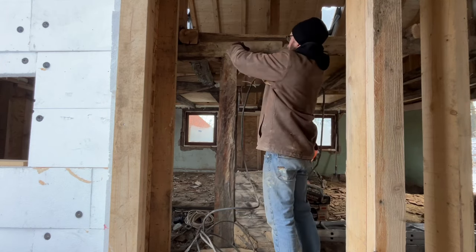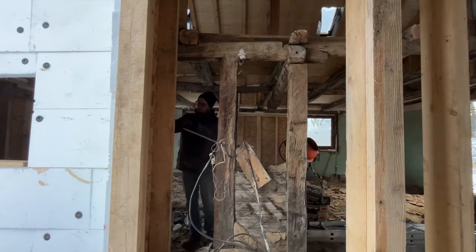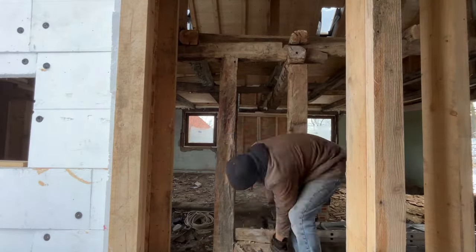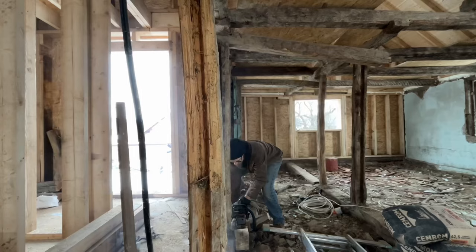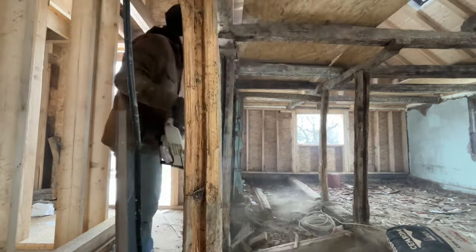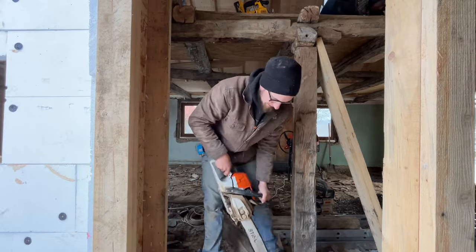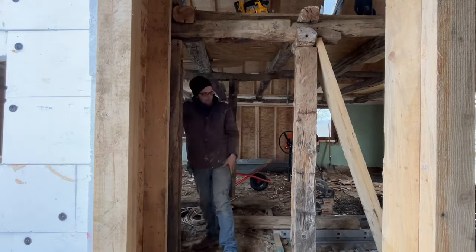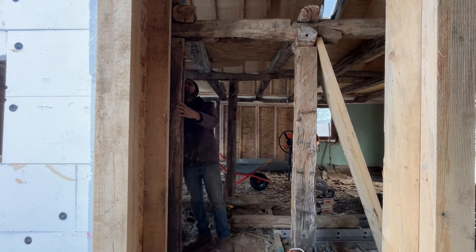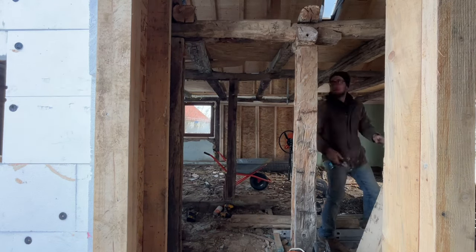First of all, I had to get this front entrance adjusted here. This is where you step inside the door right here, and then this is where you step down into the main house. I had to tear apart this wall that was left standing and then move this post over a bit to make it line up perfectly. There was another beam going across the top that I had to take out, and we had to replace two of the posts in the middle there. I used some new posts, poured foundation and footer. This is just getting that post on the other side of my door to fit in nicely so my drywall can come up basically halfway in between and it all looks like a full mantle around the door coming in.